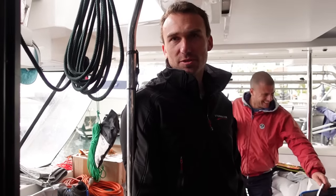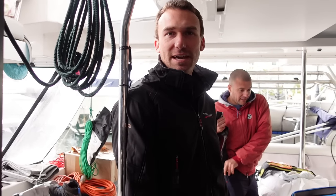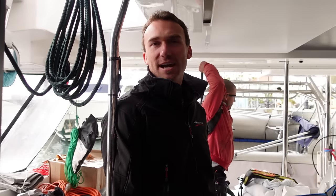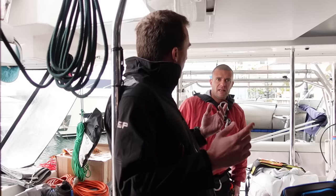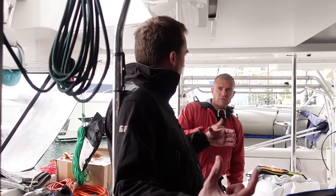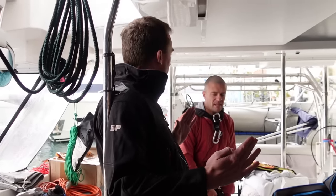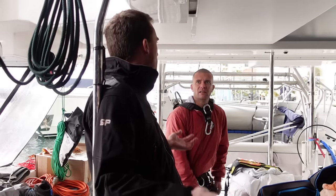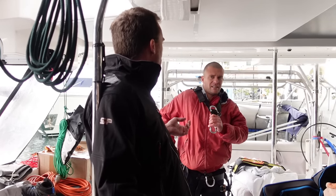So to do them up, which is the process we've been told, but hearing it from the manufacturer carries a lot more weight than hearing it secondhand. So to put it back on, the mast and the forestay go on while attached to the crane. You put the forestay on first, then the mast is seated. Then you put the outside shrouds on. Yes. And then go to three quarters tension, which is about 2,700. That's full tension. Yes, full tension.